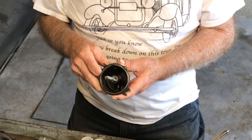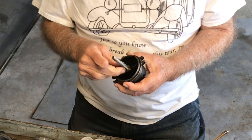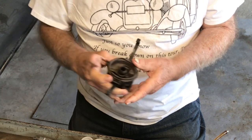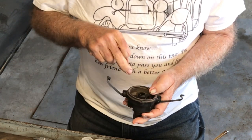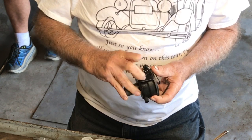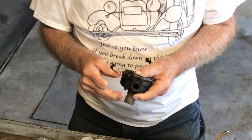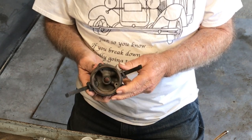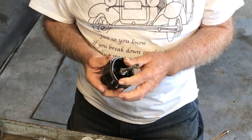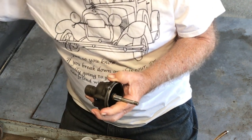The first thing you do is take your body, strip it all down until you come up with something like this. Then I sandblast them — bead blast them or whatever — and clean them good. I want to make sure that thread holds good, that thread holds good, the threads are good, it's not broken, and there's no crack down in here. After I check everything and have a good one, then I'll change the bearing.